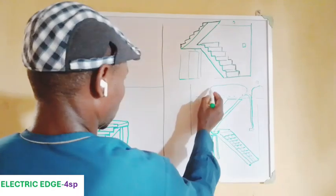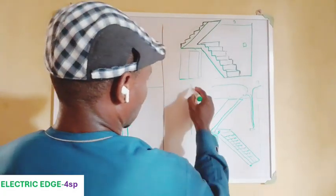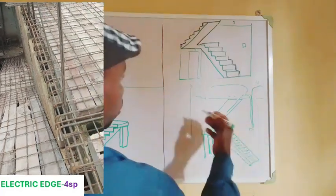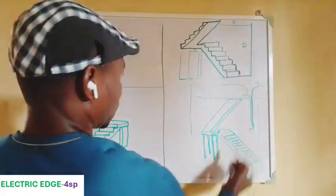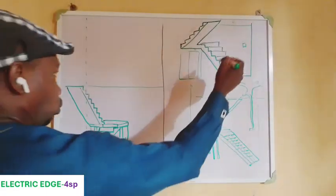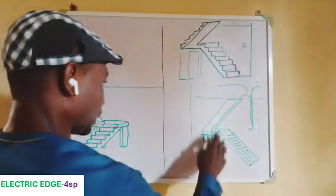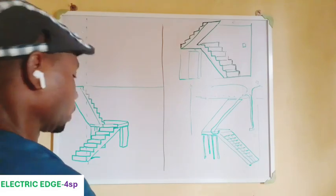The wall facing the staircase can have a lighting point that will illuminate the staircase. There can also be a light before you reach the switch, so you can turn it on to see the staircase before climbing. The switch here can be two-gang or three-gang, so you can light one point, then another, then another, ensuring the whole staircase has full illumination and you can climb comfortably without any problem.